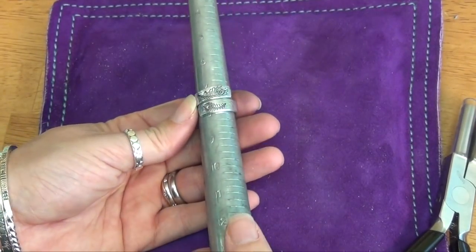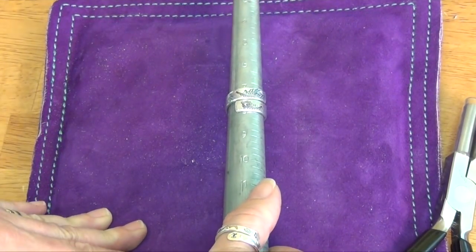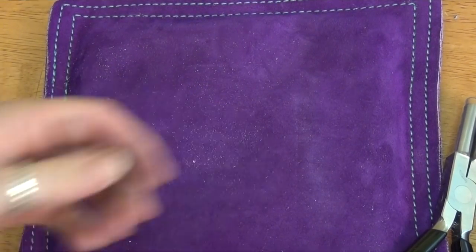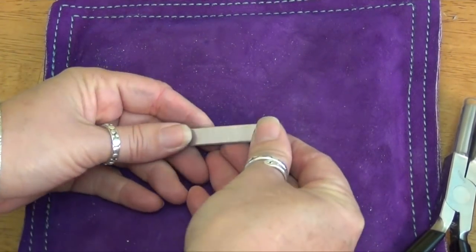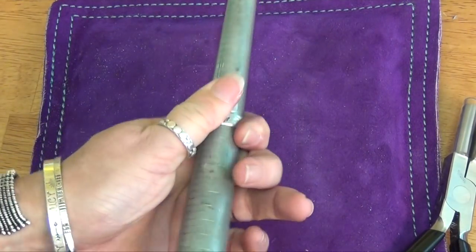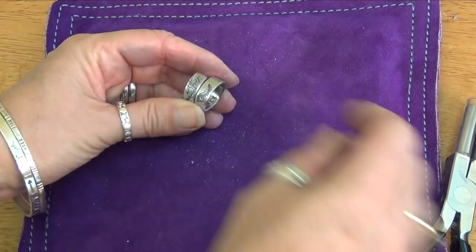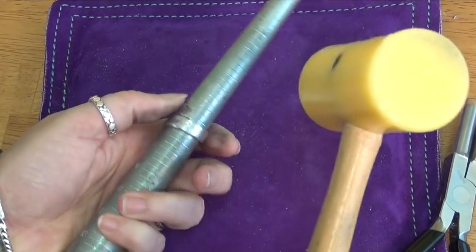Can you make the wrap-around ring without a tool? Yes, you can wrap it around something round like a thick marker. The metal has to be really, really soft — the tricky part is getting the little ends to behave. You can try bracing it on a table and pushing down and rolling it. It is doable, but if you're going to make more than a couple rings it's a lot more work. All metals work harden, so spending time sizing and hardening on the mandrel helps it keep its shape. These blanks come really dead soft but they will work harden.